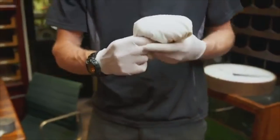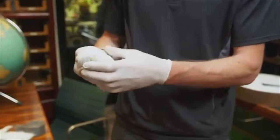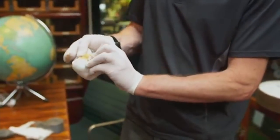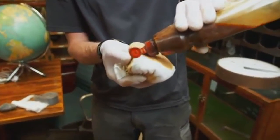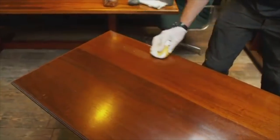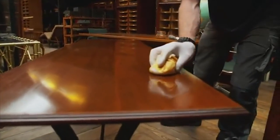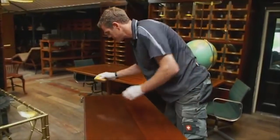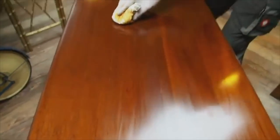We fill our cotton wool ball, scrunch it together and give it a little twist. Personally, I like to bash it on the back of my hand to get it nice and flat. Twist again until it starts to soak the rag, squash it again, then apply a little bit more onto the face. We start with very slow, straight, and gentle strokes across the surface — the important thing is not to overlap too soon. It must dry before you do another stroke across the same spot. Do very slow, very smooth strokes, taking your time to flow onto the piece of timber and then flow off the end. You hit it moving — you don't put it down and start moving. To get a top like this nicely polished, you'll need to use the rubber for about 10 minutes.